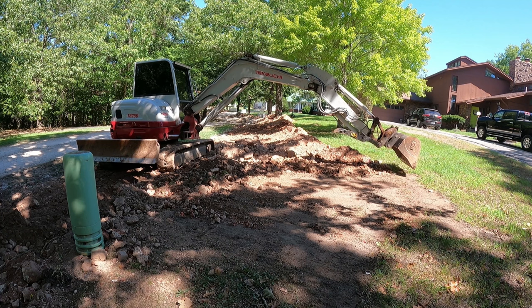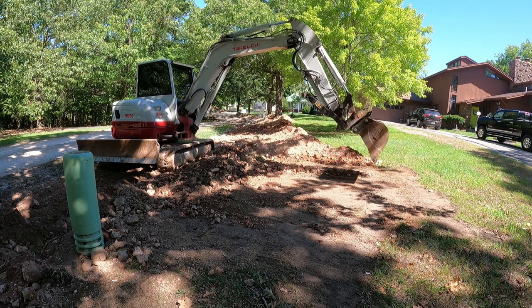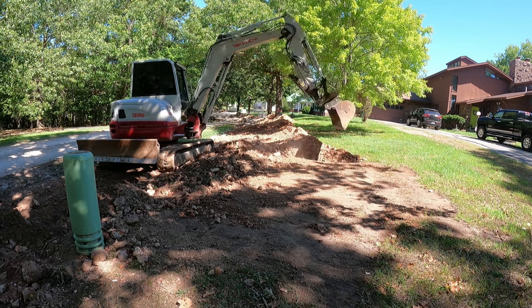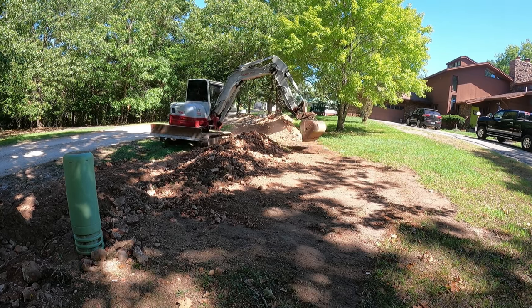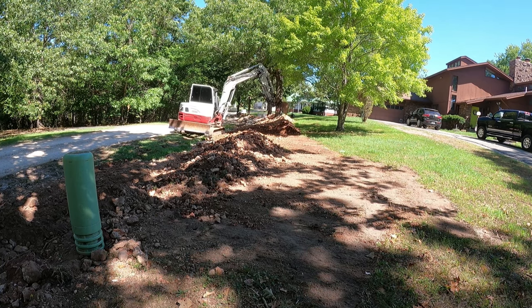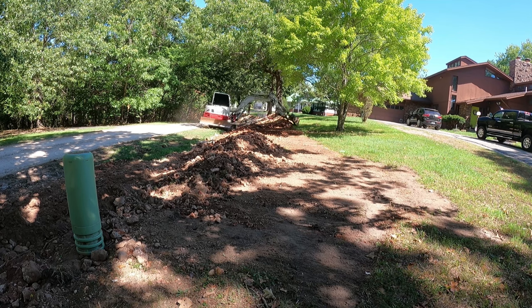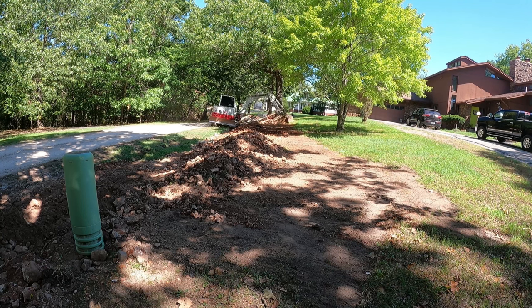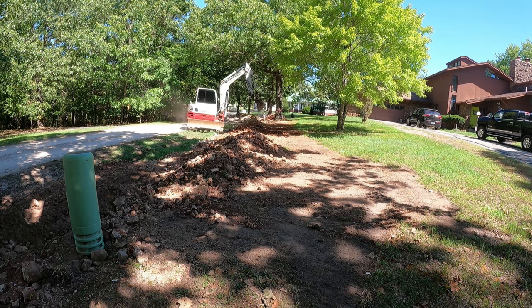There was a little bit more digging that would have been in this video, on the beginning, right before we rolled that pipe out. I did try to explain how I was having to bed the pipe in and what I was doing. The pipe we're using in this video is what they call IPS, which means iron pipe size. It's 2 inch still, but it's the outside diameter of 2 inch PVC or plastic or iron pipe. Like I said, the water company came out and fused the two pieces together. You're supposed to bed it in with what we call screenings here, basically fines, 6 inches below the pipe and then 12 inches above the pipe. That's what you saw at the beginning of the video.